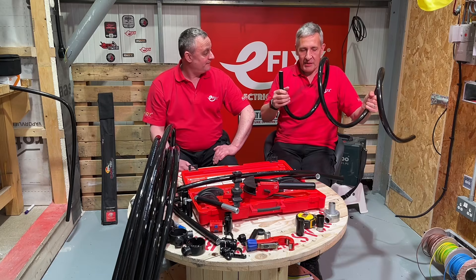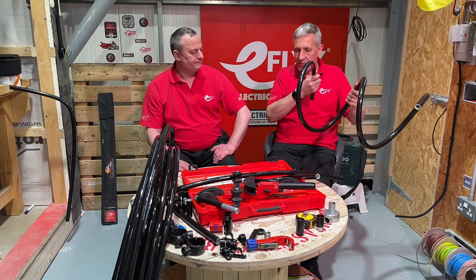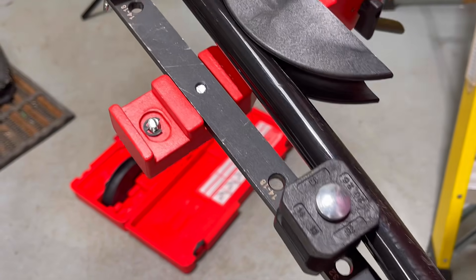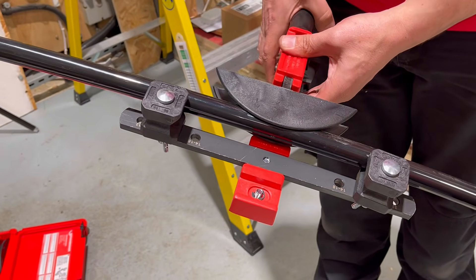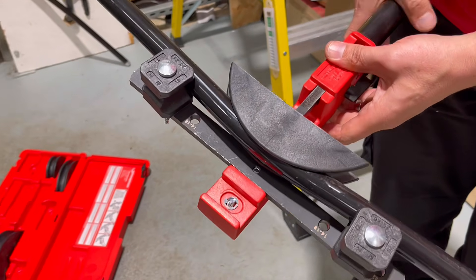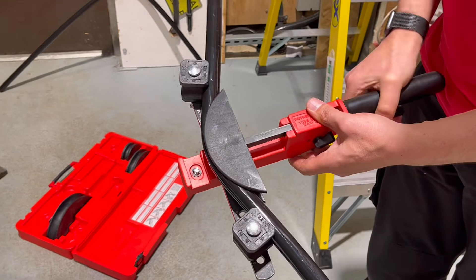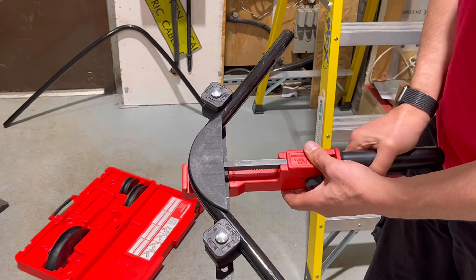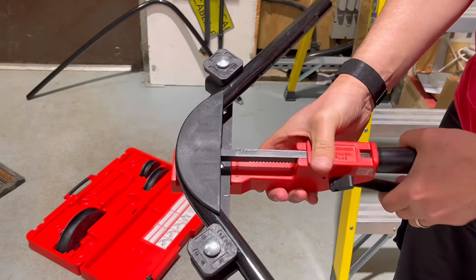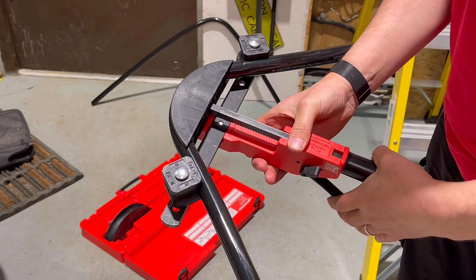As long as it's in black. Now by hand you can do quite slow or relaxed bends, but if you want a precision bend there's this pipe bender we've had a go with. It's a fantastic bit of kit — probably from the world of plumbing — but that ratcheting mechanism to make the bend is very satisfying. It saves time: if you've walked up the stairs with 50 meters of this, it's considerably easier to carry up than a traditional conduit bending machine.